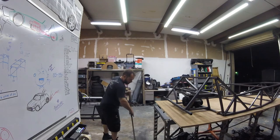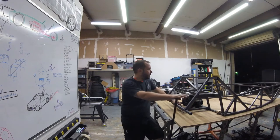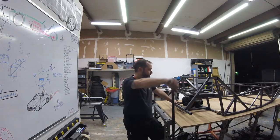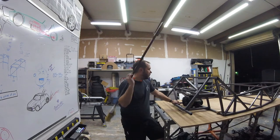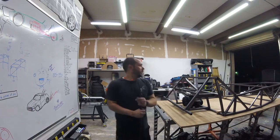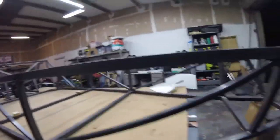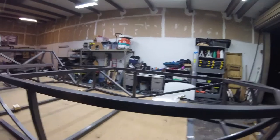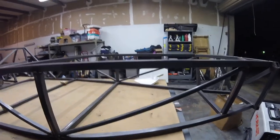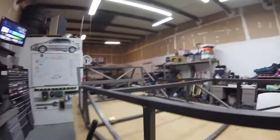It's closing time — you don't have to go home but you can't stay here. I want to thank you guys for watching me build this thing. It's a dream come true of mine to be able to do this. Hopefully you'll learn something along the way. I got those two tubes done, and then I went ahead and redid one of these front supports and finished the other one. Tacked it in. I made it out of round tubing — I've seen other low-cost chassis with round tubing there for the brace. I think it looks kind of cool, plus I got a bunch more round tubing than square.